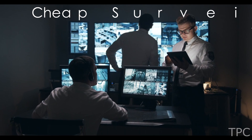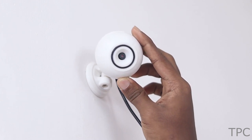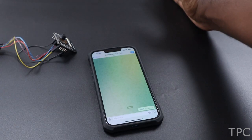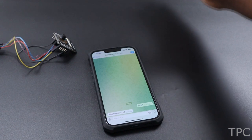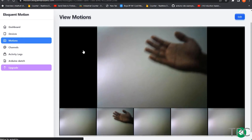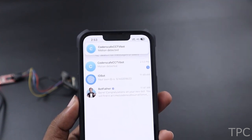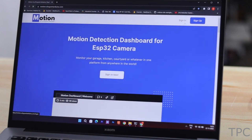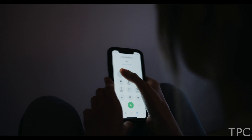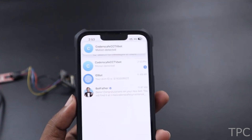Number 2. Are you looking for a surveillance project at a very low price? Then under $10, you can make a surveillance camera using an ESP32 cam and a 3D printed frame. The camera itself detects movement and does not require a PIR sensor. As motion is detected, it notifies you with a message on the Telegram application. If you have an internet connection, you could view images and short footage of the intruder from anywhere and take necessary actions. With this project, your premises are secured on a limited budget.